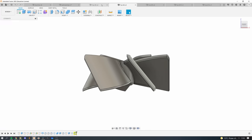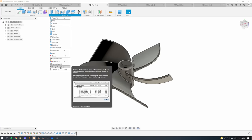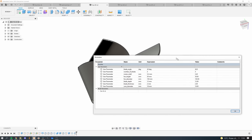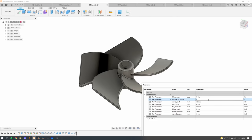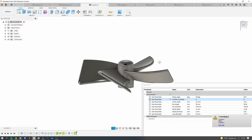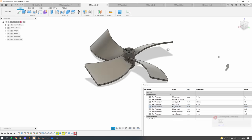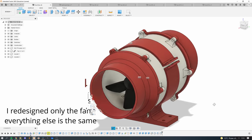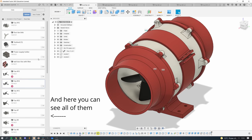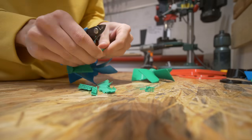To simplify the fan design process I designed a parametric fan. It's not fully parametric — sometimes you have to tweak some sketches — but with parameters you can modify quite a lot of stuff, and that simplified designing 15 or maybe even 16 fans in the end. The diameter was the same for all fans, so I decided to modify only the number of blades and the angle of each blade. I printed the fans with PLA on Ender 3, DIY Prusa i3, and CR10.